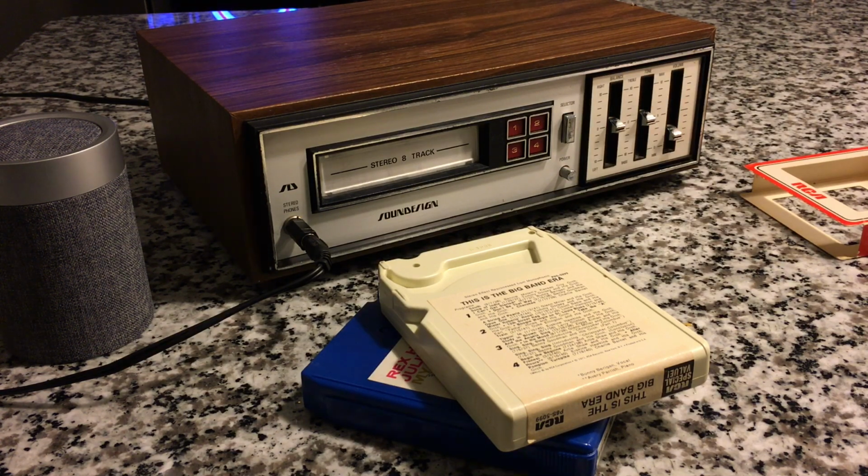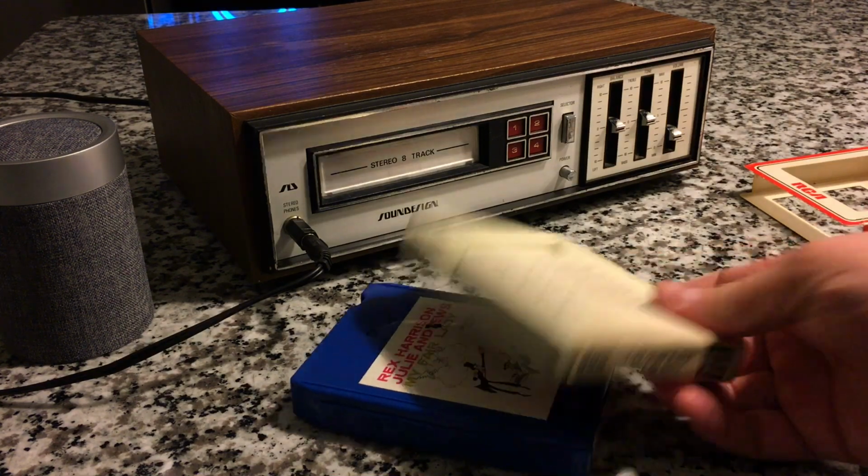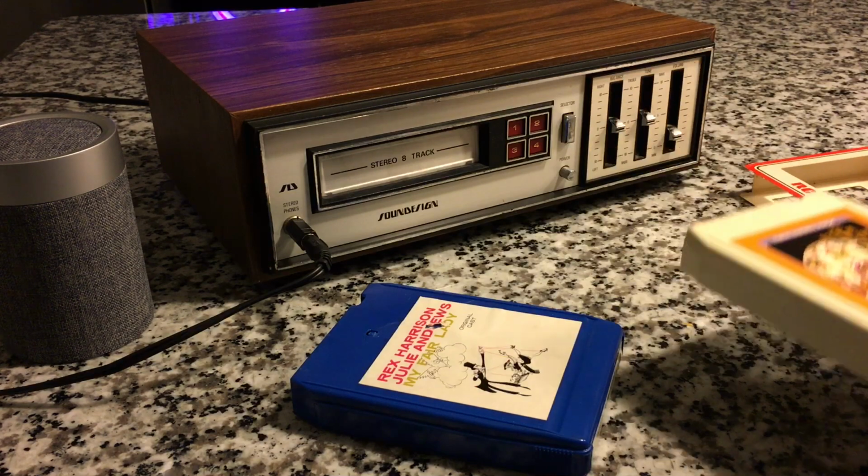Also, these experience changes in their linear velocity. The tape does. So the tape that's around the middle part of the spool, just like a record, is spinning slower than the tape that's fed to the outside of the spool. So what that means is slowly, as the tape works its way to the center of the spool, it actually has to slide on itself. So the back of the tape is coated with a special graphite coating that allows it to slip effectively without damaging it. So as you can see, the tape goes through a lot in the process. So that's pretty much all there is to it. It's an interesting format, but again, not one that I've been particularly aware of.